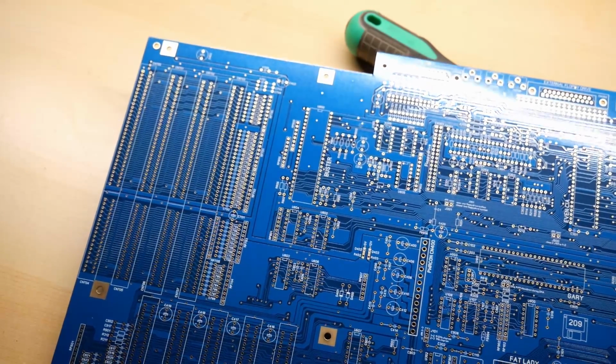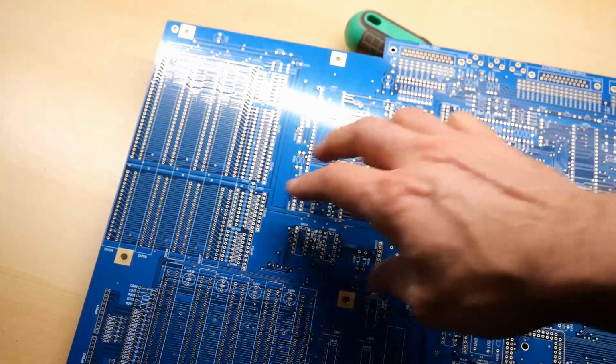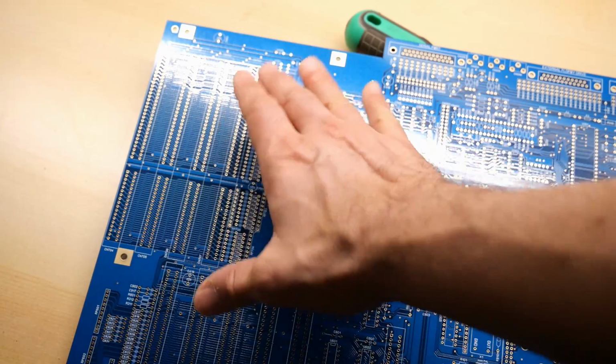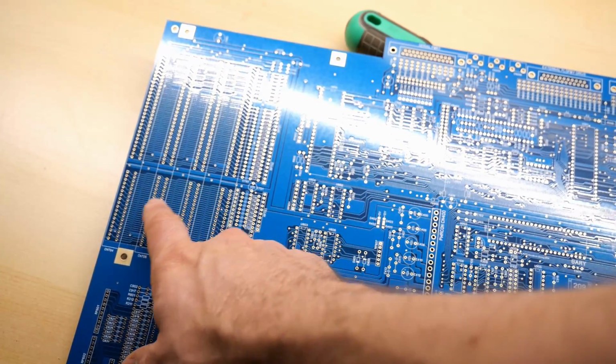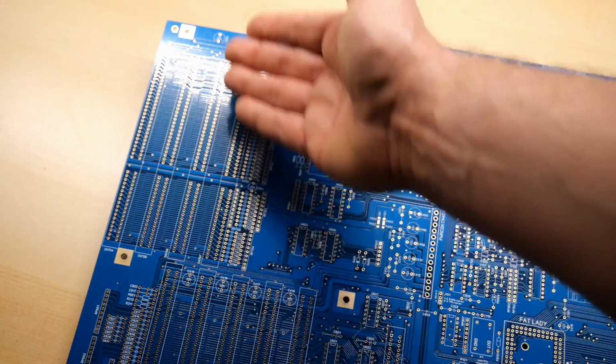And the whole design of those slots is you are supposed to use what's called a bridge card. It basically gives you IBM PC compatibility on your Amiga. And the PC side of that bridge card is connected to these ISA slots, allowing you to plug in things like a VGA card or a network card or other ISA accessories.